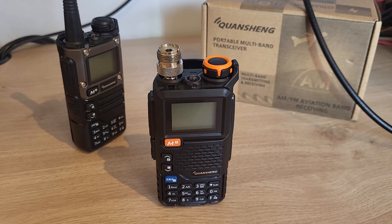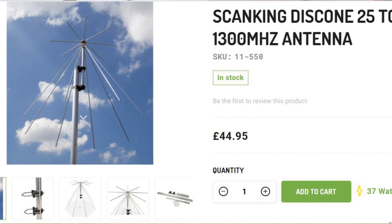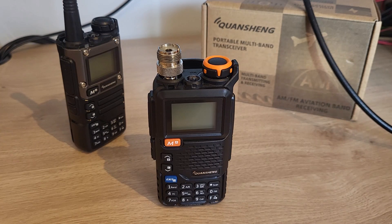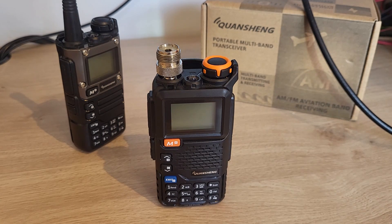So in summary, there's no one antenna that's going to be perfect for everything. If you want to listen to airband or VHF marine, you might want to get yourself a discone or scanner-type antenna. If you want to listen to 10m, 11m, or anything on the top end of the HF band, something like a long piece of wire would be perfect. Have a think about what you want to listen to, what bands you want to cover, and what would be the best antenna for you. Have a look at a few websites, look at a few reviews, and enjoy the radio. I hope this has been a useful video — if it has, please hit the like and subscribe buttons, and we'll see you on the next one. 73.